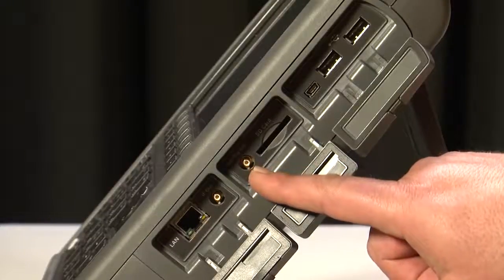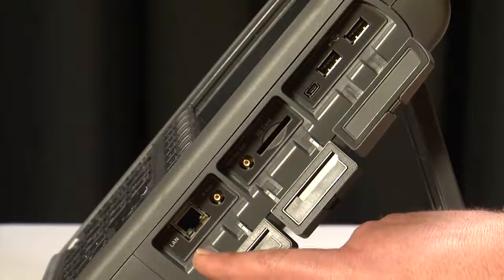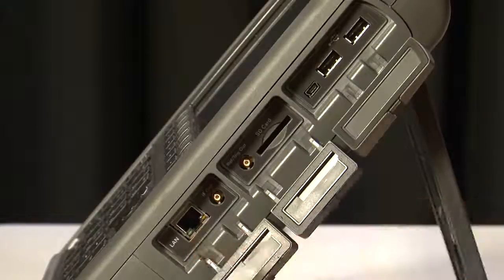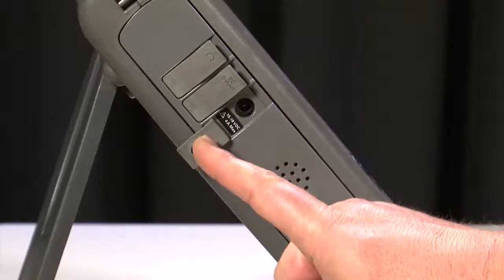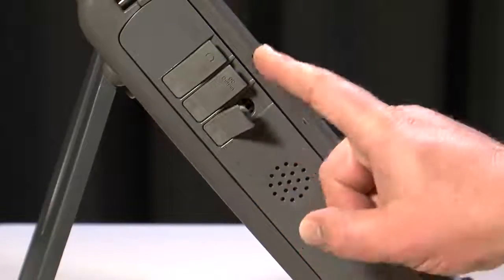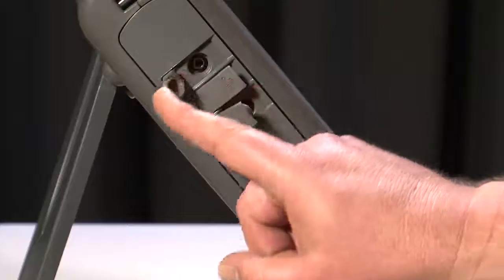A time-based reference output and trigger-out port, and a 25MHz spectrum analyzer IF output for wideband signal analysis. There is an Ethernet port for remote control over a local area network and SCPI programming, and an easily replaceable lithium-ion battery. There is a DC input jack for powering and recharging the instrument from the mains or from a vehicle cigarette lighter socket. Here is the variable DC output for powering an LNB, LNA or a BIAS-T, plus there is a standard headphone output jack.